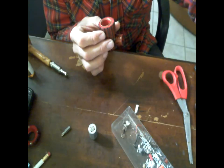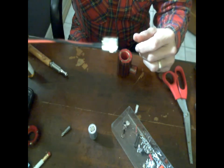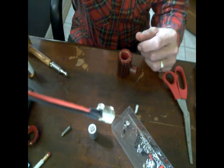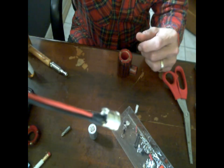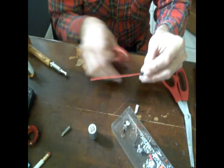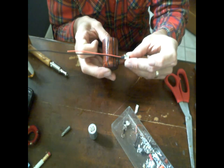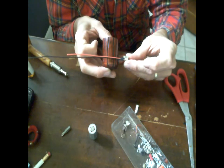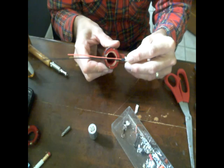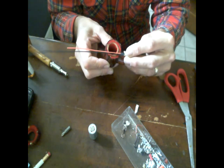Now I have a 510 connection which I have already pre-wired. There is a heat shrink on the positive to the back of the connection, and then a second piece of heat shrink that covers both wires as they come out — it gives it a little bit of stability. The wires are very long; I don't need this much. So I eyeball the positive wire from where the connector is going to sit. You want to cut the wire to where it's going to be just past the center of the hole where your battery is going to sit, because you have to put a positive terminal down there.